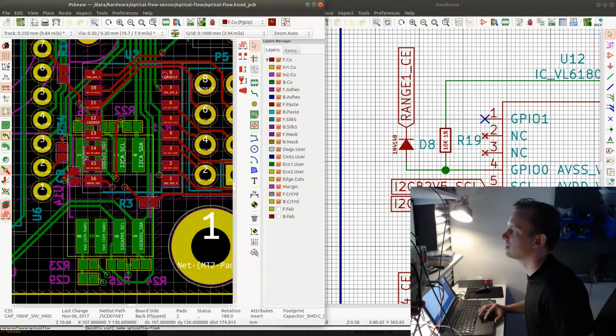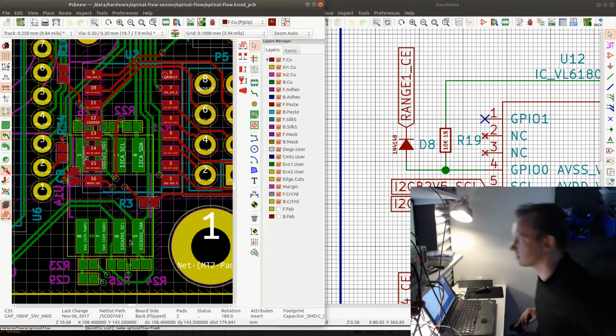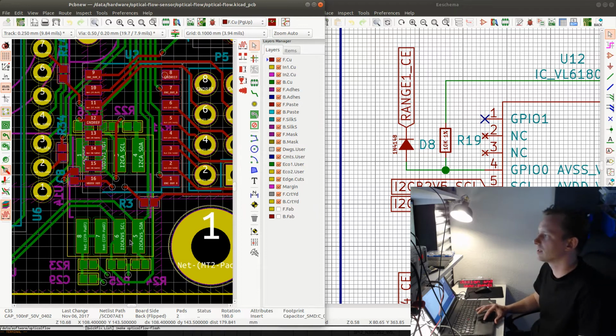So it's going to go from here, from the 2.5 volt SDA. It's actually supposed to be 2.8 volts. This is just an error in the labeling, which I didn't discover because I didn't actually review this board, which is something I regret a lot. Because I had to do a lot of hacking on this board.